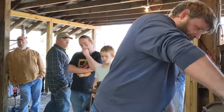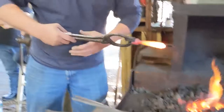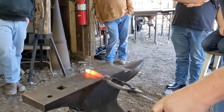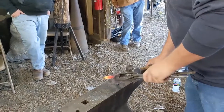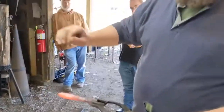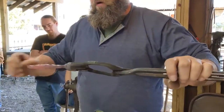Too much time beating on low temperature and you can work it out by using the fuller edge on that hammer. I'm not hitting flat — I'm hitting on an angle, and I'll create what you call high-lows. You can see these high-lows in it. It's the same way as when you work over the edge — you turn each time and create high-lows. When you smush these highs out, it pushes everything forward. You do divots in, then push them out when you come back to flat. Do that on two sides, and when you push them all out, it stretches your metal.